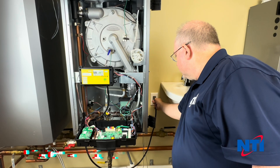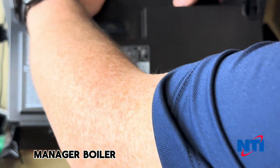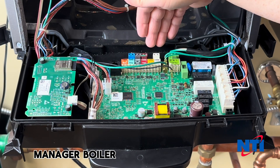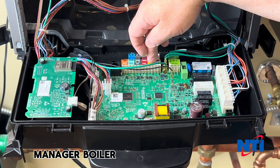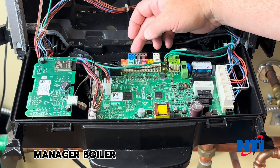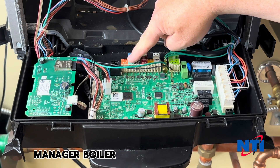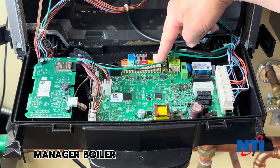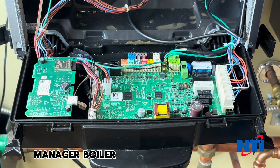Remove power. Back on the master boiler now — drop down the control panel and remove the cover. On your master boiler is where you wire everything: your TT from your thermostat or zone controller, your system sensor, your tank sensor if configured for domestic hot water, your outdoor sensor, TT2 only if you're going to use the second zone capability, and then your e-bus. Wire in the e-bus last after all the rest of the wiring for sensors is done. Leave the Wi-Fi connected — only the master boiler has a Wi-Fi connection. The dip switches on the master boiler inside the junction box are left in place.